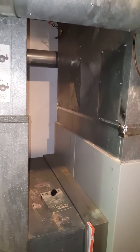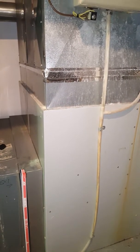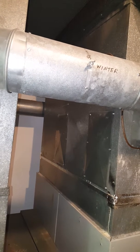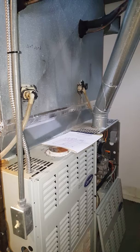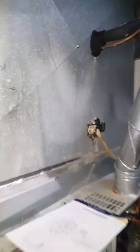If they're doing furnace only, the plan is to turn the furnace to face our way and install it here, since the electric and gas are already in place. If it's easier to push it back, we can do that — we'd just have to rework and cut the ductwork going straight up, patch it off, and rework the gas and electric over to that location.